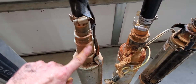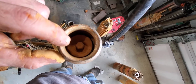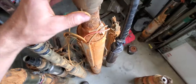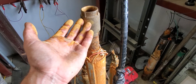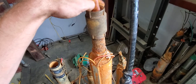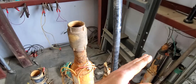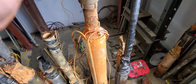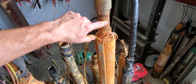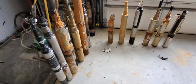In a situation like that, it all leaked out of the crack in the pipe. Or you could have a check valve that has failed. Come over here — this was a failed check valve. You can see that flapper down in there; it rides on a stem with a spring, and when water goes up it lifts that cap and water travels around it. Eventually that flow erodes and deteriorates the cap so it no longer does its job, and every time the pump kicks on it'll build to pressure, then when the switch clicks off the pressure gauge slowly goes back to zero.